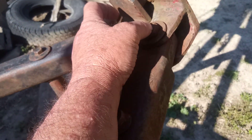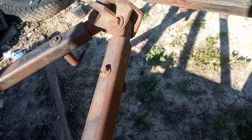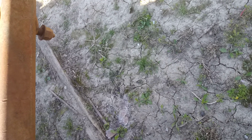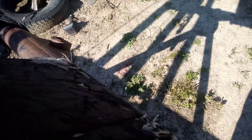Then you're gonna have to have two boxes inside this box tube, pinned here and bolted here. You're gonna have to build one of these channel pieces too — it doesn't look easy, but obviously somebody made it out of steel. The channel looks like it's at least an inch and a half deep for those tubes to fit in. The piece measures about two and a half inches.